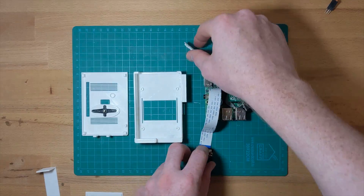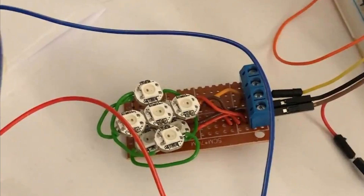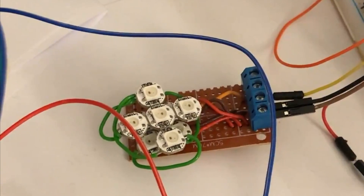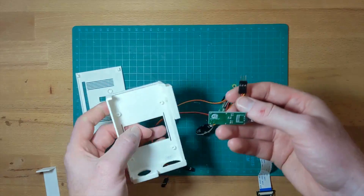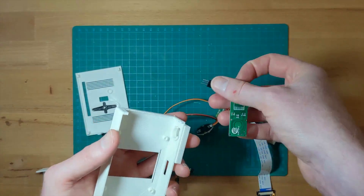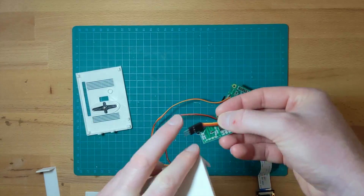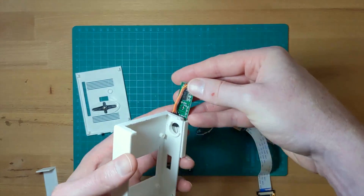The robot uses a Raspberry Pi, an Arduino, it has facial detection and recognition, audio output and NeoPixels, which are addressable LEDs. It has a microwave sensor so that it can manage detecting motion without having a PIR, because I never really liked the look of PIRs and they're a little bit limited — whereas this actually works through walls, so it means it's a little bit more useful.